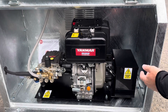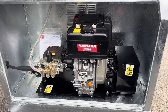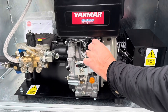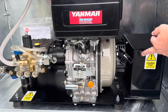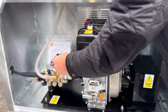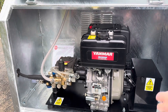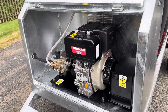It's all electric start, so easy enough to start. Just make sure the fuel tap is in the on position. You turn the choke to the off position, press the start button and away you go. Then you can adjust the pressure — there's an unload valve so you can adjust the pressure more or less. That's a 3000 psi diesel washer.